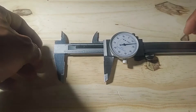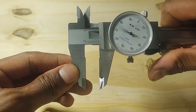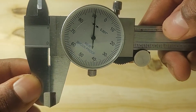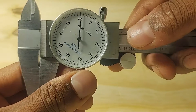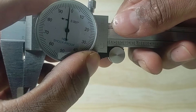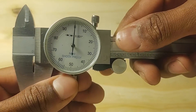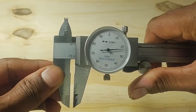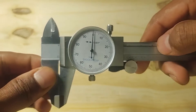After you've cleaned your measuring surfaces, you can start calibrating your caliper. Close the jaws and the needle should rest directly above the zero. If it's off, loosen this knob by turning counter-clockwise — this allows you to rotate the dial and put the zero directly underneath the needle. Then tighten it again by turning clockwise, and test it by opening and closing. You can see the needle is directly above the zero. That is how you calibrate the caliper.